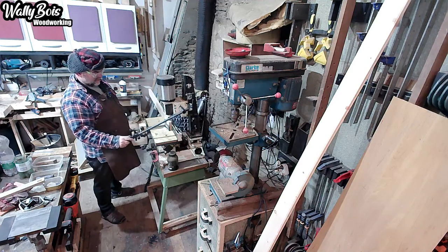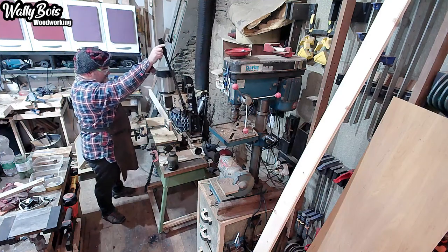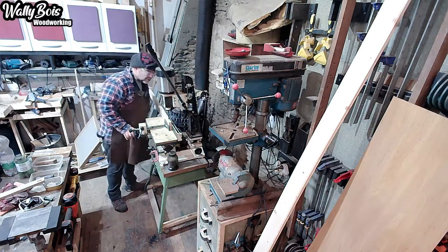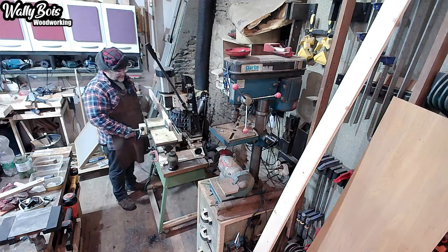That stopped to there. So now if I come back up again, the chisel itself is basically cutting the corners out of the round to make the round into a square, which we'll show you in a moment. Looks fairly centre-ish.